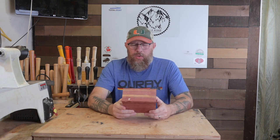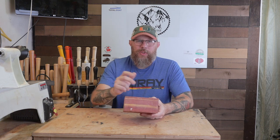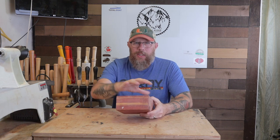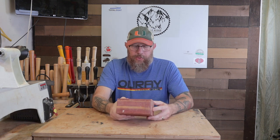I've got a piece of cedar here. It's about six inches square and about three inches thick. I'm not going to round it on the bandsaw, only because I want to try to preserve some space. It might take a few more minutes, but I think it's a give and take — drilling a hole, getting it on the bandsaw, cutting it round — versus just doing it with a roughing gouge on the lathe, which I can probably knock out quicker since it's going to be pretty easy to cut.